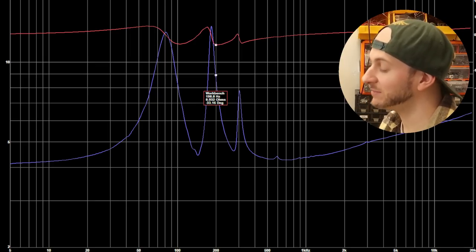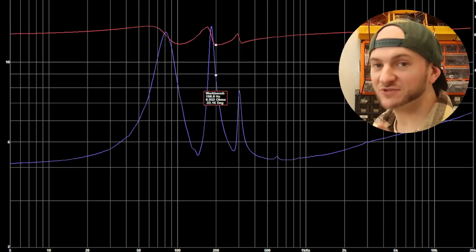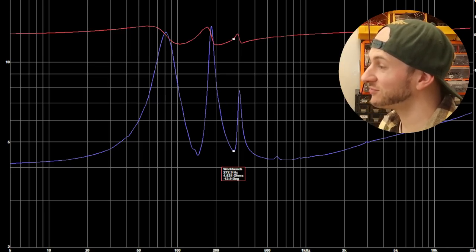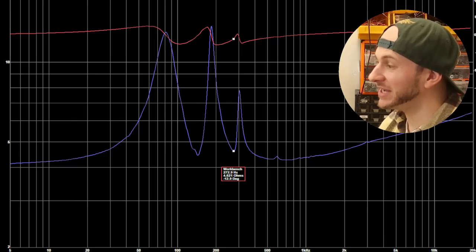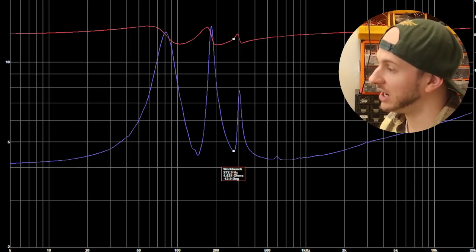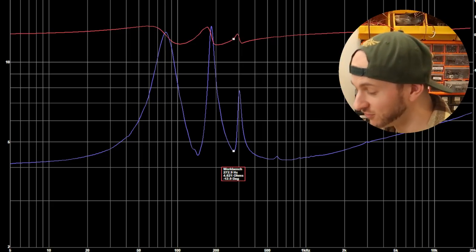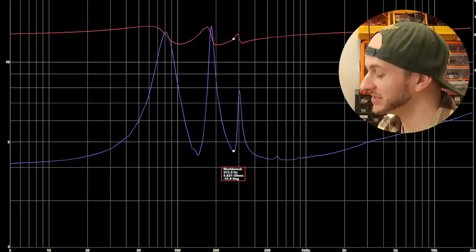So okay, we're going to get a bit of excursion there at the 33 scaled hertz, but that should be fine. The next frequency we play is a 270, and ding ding ding, that's pretty much dead on the next impedance valley. So that second impedance dip is going to be the Helmholtz mode of that first chamber, that first port after the driver that's going to be loading the cone up at that higher frequency at 272.